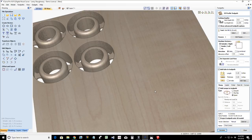With the profile cuts in the roundover, how would you leave tabs so they do not get trimmed off? David, I think you asked that question before I demonstrated it, so hopefully that demonstrated it. Let me know if that answered your question. It would cut them out, wouldn't it? Yes, it would. When I cut that 3/4 inch thick that first time around, it cut the tabs away. They were gone. So I had to go back and readjust the setting. I didn't think ahead when I created that toolpath, forgetting that the tabs cut from the bottom of the cut up.